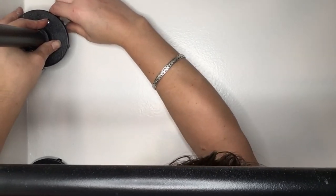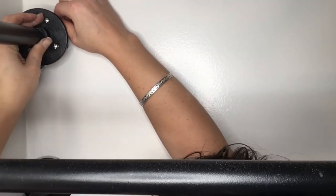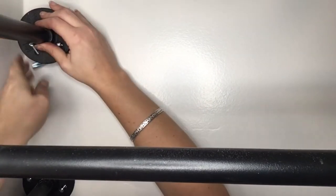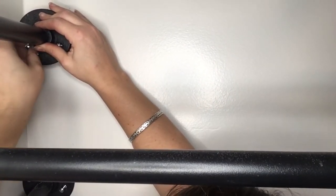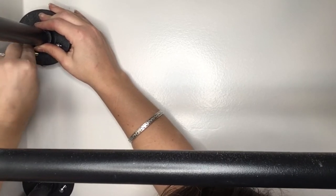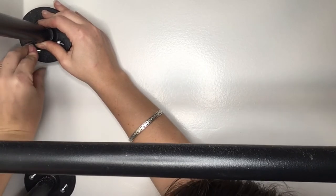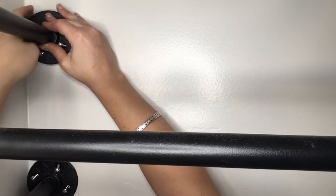A toggle screw is a little different - if you were to just try to screw it, it would just spin and spin because there's nothing behind it, nothing at all except for that T-toggle piece. So what you have to do is apply some pressure and pull it back towards you while you push on the screwdriver. It works - and as you'll see at the end of this video, there are actually clothes hanging on them.